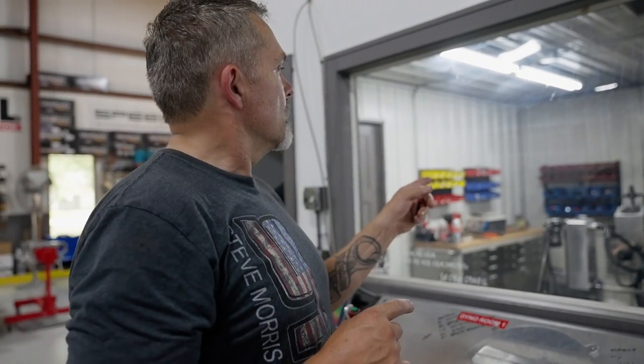I just came up with a little revision where I'm measuring oil pressure after it's run through the complete engine on my car. So it's at the back of the block, where it takes oil pressure after everything has been fed, including the lifters, and it's taken at the lifter valley, and it's like 95. So pretty happy about that.